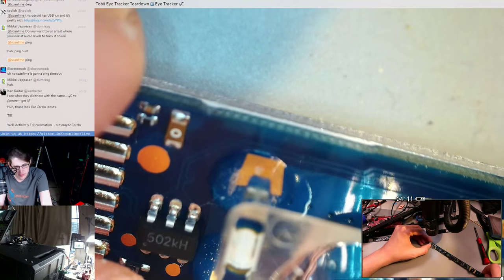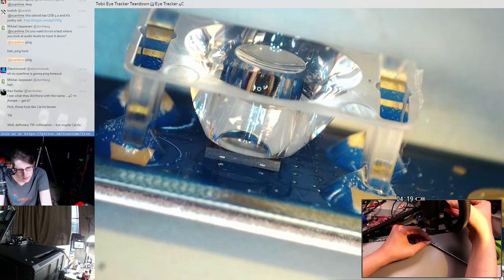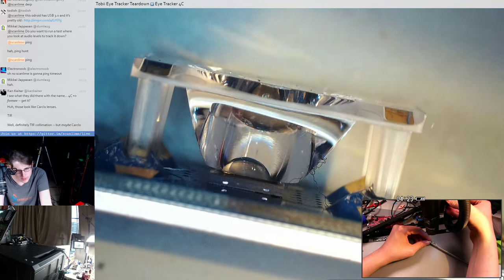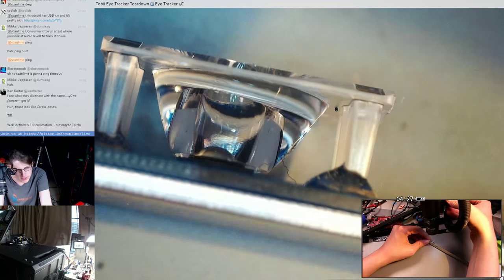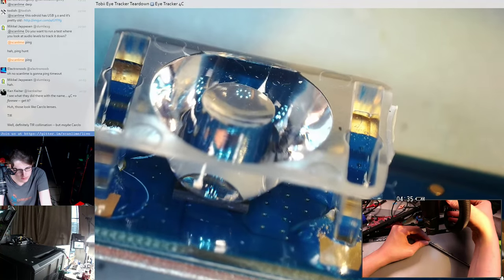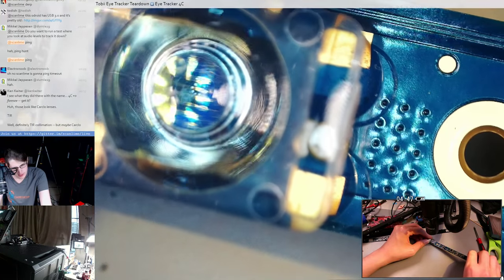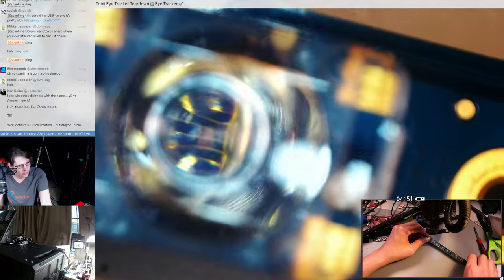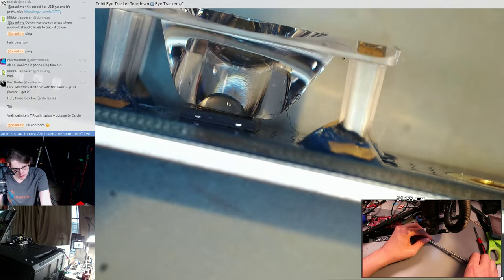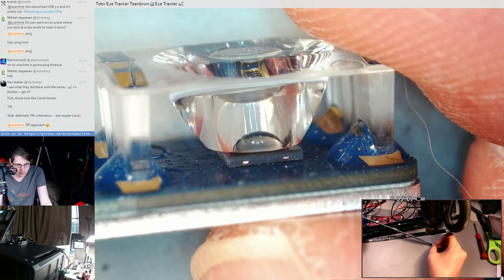Just the metal. So for each of these lenses, it looks like there's a hollow space that the LED fits into, and then that actually shines up onto this thing that is convex from the LED's perspective. A lot of reflections going on there. I think the LED die angles out right about there. And we can see something pretty much identical on each side of this, I think. So on the opposite side, a lot of via stitching for heat sinking. Same lens arrangement, but pointing the opposite direction.